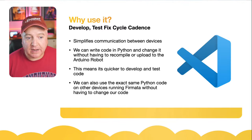Let's make a much more interesting program. So I'm going to head over now to a different program I've written. I've called this one smars.py. So we're going to import the exact same things, pyfirmata from Arduino. From pyfirmata, import Arduino, import time, import sleep from time, and then bot. I'm calling this one bot rather than board this time. So Arduino, and then the serial port that we're using. We're just going to print that out again just so that we can see it's working.